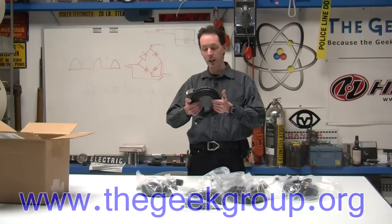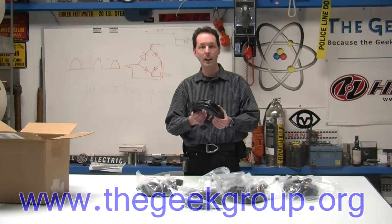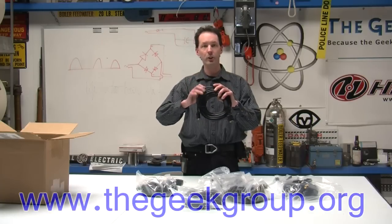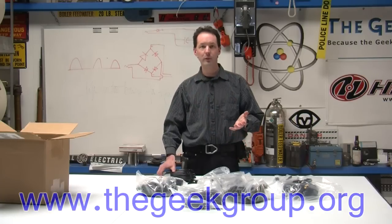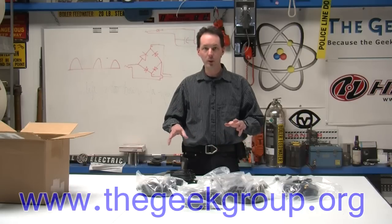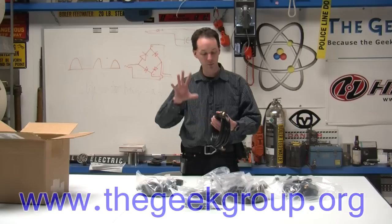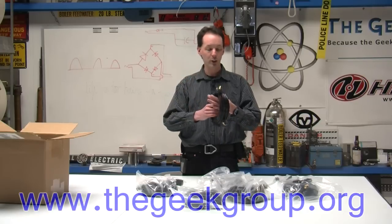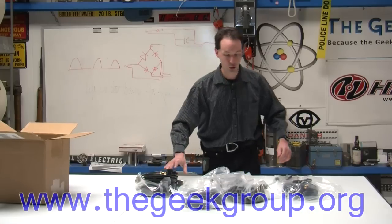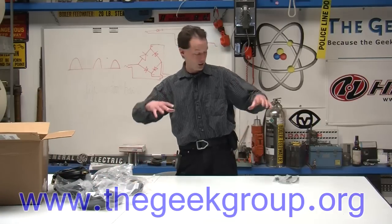Now, if you look around, you'll find a lot of VGA cables out there, and there are huge differences in quality. If you get the crappy ones, they're thinner and they don't have all the shielding they should. Normally this isn't a problem if you're just hooking it up right from your computer to your monitor, but if it's anything more than like one meter, you're going to have problems — you'll get noise and you'll get fuzz on your screen. So these are good shielded ones, they're very nice. Thank you to all the guys at ShowMeCables.com, and we're going to install these right after we're done here.